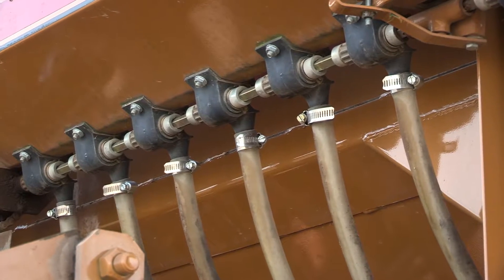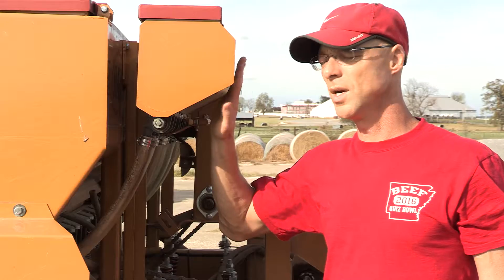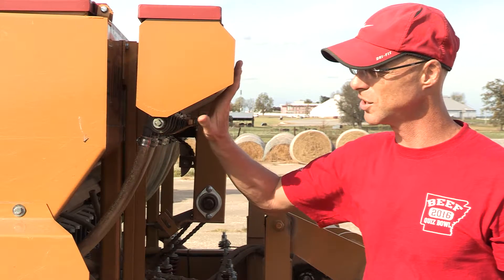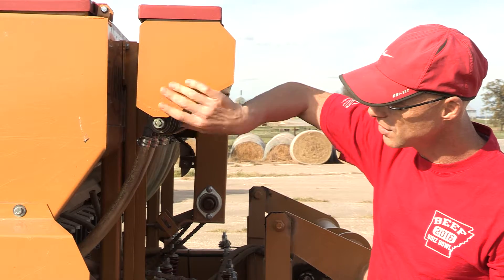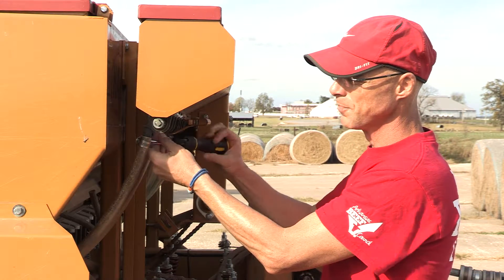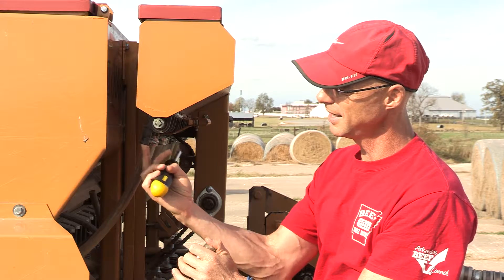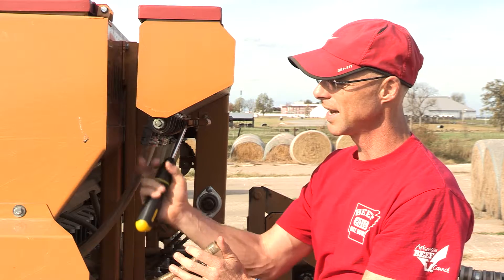Dirk Phillip from the University of Arkansas Department of Animal Science has some advice on cleaning the drill before storage. One of the places where the seed can plug up that seed feeding mechanism is right below the front seed box. That seed box is used for small seeds like legumes or anything else, and it's going to be fed out of the box right down below those tubes. What you should do is take the tubes apart, pull down the tube, and a pretty common spot for spider webs or anything else is in here — you can poke with your screwdriver carefully to clean it out if there's anything in there.